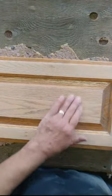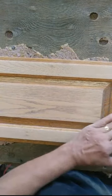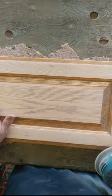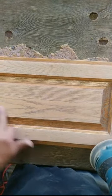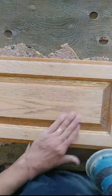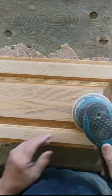All right, I'm going across the grain to catch it, because this oak has such a coarse grain. It's incredible how coarse this grain can be, a lot coarser than most other woods, but it's a very hard wood all at the same time. Hard, like a rock. So it's a little bit more forgiving than other woods. Okay, cherry wood is also another hard wood, but we're not dealing with cherry, I'm just saying. So we're making it a smoother wood grain, so it takes this black better.